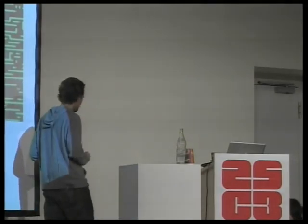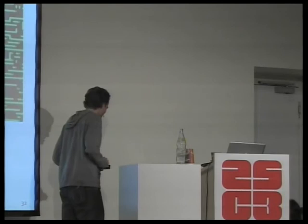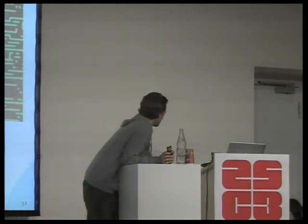What polishing paste are we using? 0.04 micrometer grain size. Is it diamond based? Silicon based. Thanks, Starbug. Yeah, you can probably take pretty much anything you want as long as it's not too grossly grained, so you don't scratch your chip.